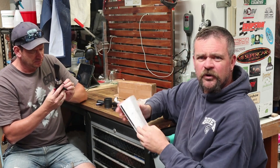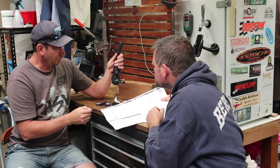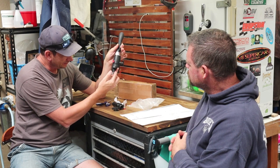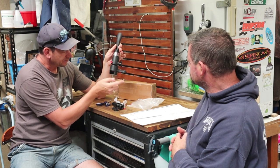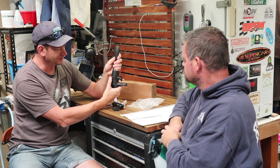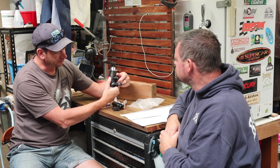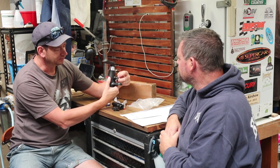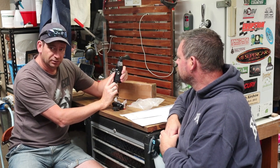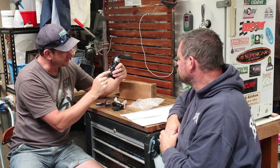Let's refer to the diagram. So when you turn the bottom handle here, you can see it lifts the bottle up. The red button is used to purge the bottle with CO2. You turn the tap on to allow the liquid to start to flow. And this wing nut adjusts the speed — the flow. In the back you've got a CO2 inlet and a drain pipe. The main beer line goes through the centre port at the top.